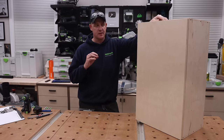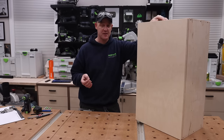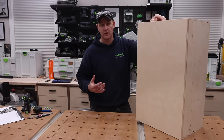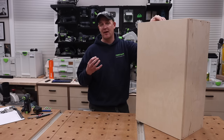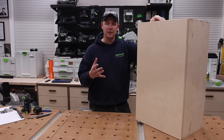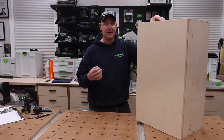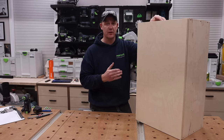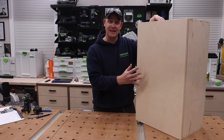When we're talking about cabinets, there's really two specific types: a frameless cabinet and one with a face frame. There are pros and cons to both, depending on the look you're going for. With a face frame application you'll have much larger reveals, and with a frameless application you'll have much thinner, cleaner reveals. Frameless cabinets typically have a full overlay or some sort of overlay, and then you have inset, where the drawers and door fronts are even with the front of the cabinet. This example is a frameless full overlay, and that's what we're going to be talking about today.